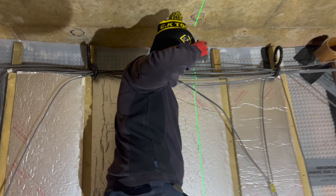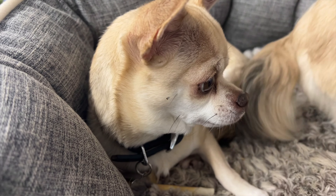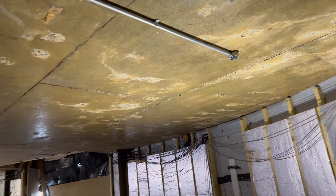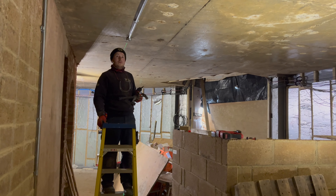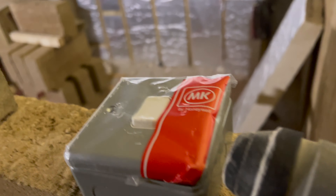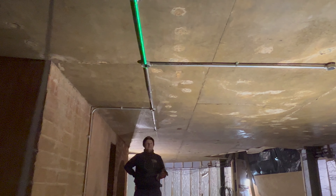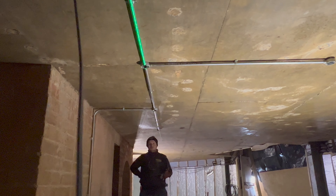It's Wednesday morning. Yesterday afternoon Reese turned up and helped with a bit of the conduit after his other job got cancelled. This conduit is all decorative for down here. We had to rush yesterday because the customer's coming today, so we wanted to give him a sample bit to look at. We've got all the MK metal-clad stuff going on down here for the switches. We've used female bushes to protect the cables - looks pretty good.